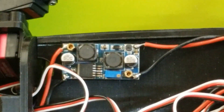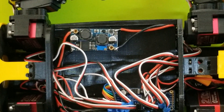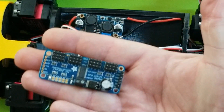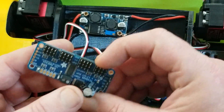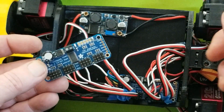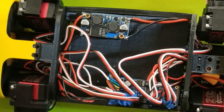Here is the 5-volt regulator — it's actually an adjustable regulator set down to 5 volts for the Arduino. Then the other thing under here is the PWM motor controller board. This is an Adafruit one, but SparkFun makes one as well. It's 16 channels, so you can put 16 motors on it. They can also be chained together — for my hexapod project I used two because that had 21 motors. For this robot with 12 motors, one board is plenty.